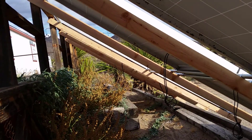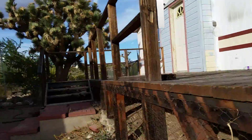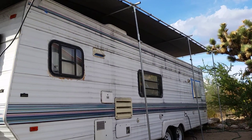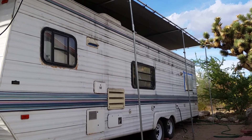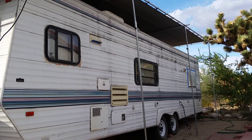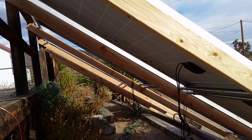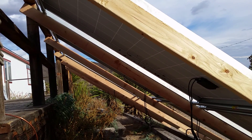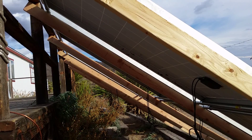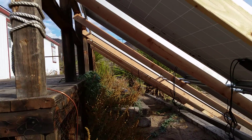I need solar. This thing runs the air conditioning a lot. I found a setting where instead of leaving the fan on low 24/7, it's on auto, so when the air conditioning shuts off the fan shuts off too. It cycles on and off and keeps power usage down. The air conditioning in that trailer draws 1,700 watts, and this should put out hopefully something close to that.